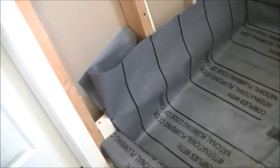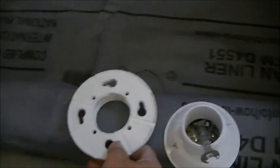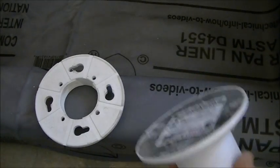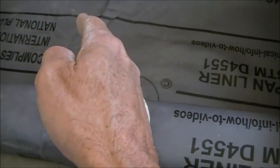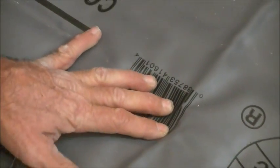I'm putting a screw in on every stud — that's all you really need. Every stud gets a screw as high up as possible. When you wrap the curb, the screws go at the bottom. The next step is the actual drain. There's a bottom drain flange already on the floor, and this is the top drain flange which holds the drain down. When the barrel goes in, it'll be stable and anchored with four bolts into these four holes.